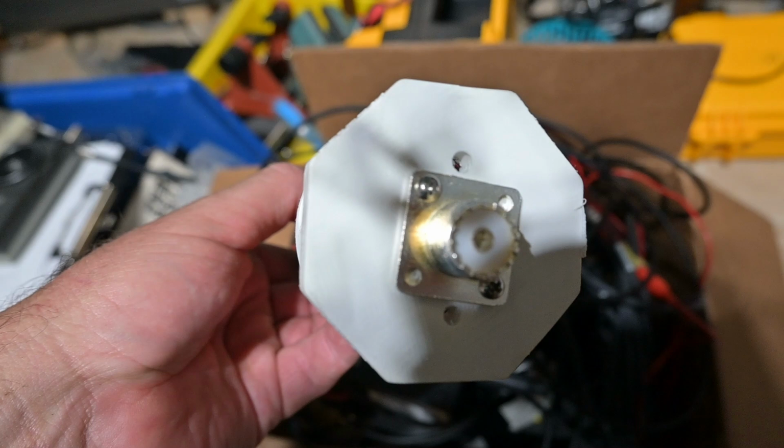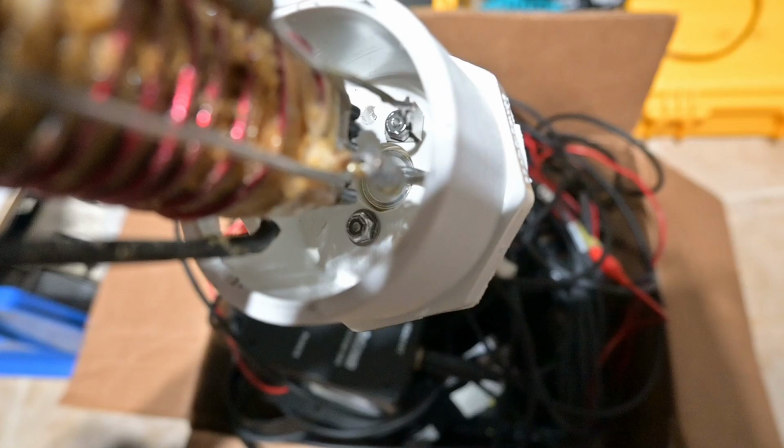Now the original RF connector didn't have enough shank to allow it to be used with this cap. So I've configured it as shown, affixing it to the cap with 2 stainless 4-40 machine screws and nylocks. I also drilled 2 drain holes. The body of the RF connector side of the balun input also has a stainless 4-40 star lock in conjunction with the nylock.